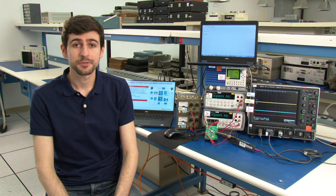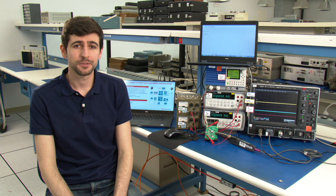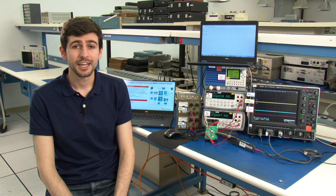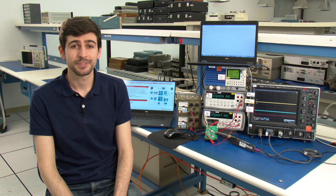Those are the three demos, and now you've seen the automotive 48 volt mild hybrid electric vehicle power solution. It meets all the specs: low quiescent current, reduced complexity, small solution size, and it meets CISPR 25 class 5. For more information you can go to ti.com/lm5164-q1 for the 100 volt buck and ti.com/lm5180-q1 for the primary side regulated flyback. Thank you for watching.